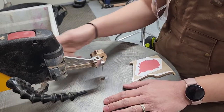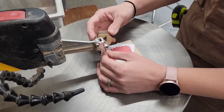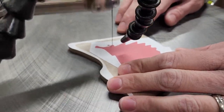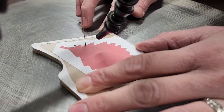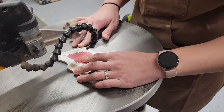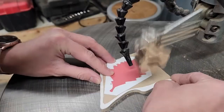To begin an interior cut, first release all the tension off your blade, loosen the thumb screw, lift up the head, and slide your piece through the pilot hole. Push back down, tighten the thumb screw, and put the tension back on your blade. As you begin to cut, you're going to use two hands — one for holding your piece down and the other for guiding your piece. Over time this will become muscle memory and you won't have to think about what your hands are doing. Don't drive your piece into the blade; let the blade do the work.